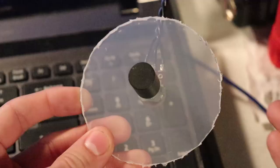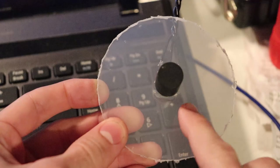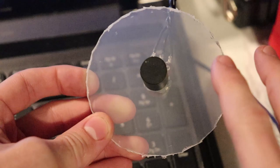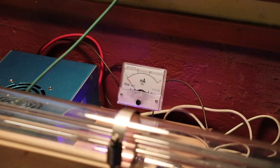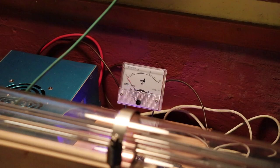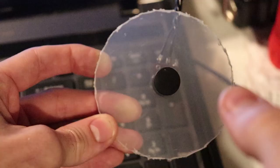As for controlling the laser power, all I have is this 20 kilo-ohm potentiometer that I use. And the three terminals are connected to the ground, in, and 5 volts of the laser power supply, respectively. It's really easy. I just control this manually and vary the voltage that goes into the in terminal on the laser power supply. Thus, I control the power that goes to the laser, or the amps that go to the laser. And because I have an amp meter connected to the laser, I can see the milliamp range that I'm controlling. So this is very handy.